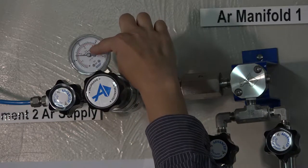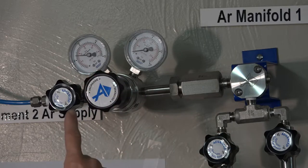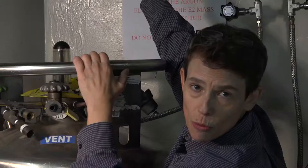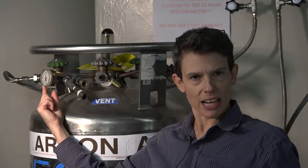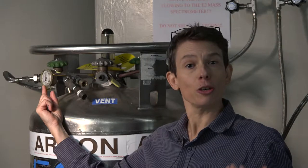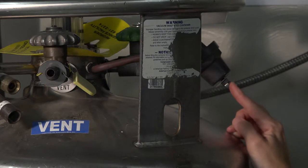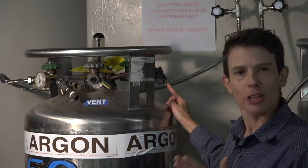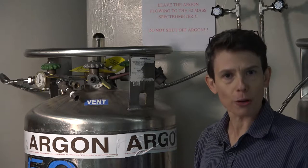This gauge is controlled by this valve. You can increase the pressure out or decrease the pressure out by turning this valve. This gauge should read 130 pounds per square inch to feed the element. The pressure inside the tank should read anywhere from 200 to 300 PSI. If it's too low, we need to build pressure inside the tank. To increase the pressure inside the tank, you turn this bolt here a quarter turn clockwise and then watch the gauge pressure rise. If you need it to go higher, turn it another quarter turn and watch the gauge until the proper pressure is reached.